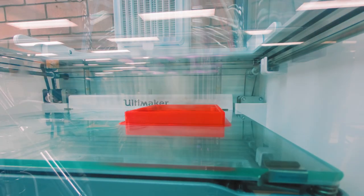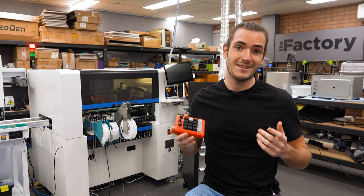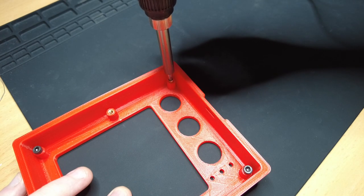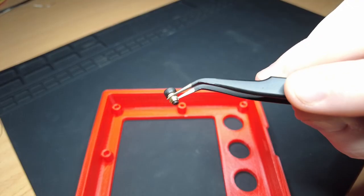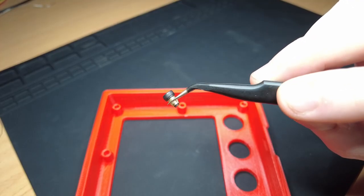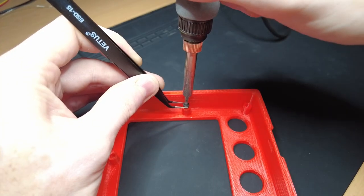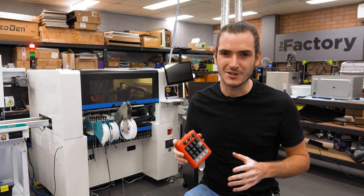The good news is the case has now finished printing, so it's time for a fit up. First the threaded inserts go in — this is my first time using threaded inserts and I'm kind of in love. A bare soldering iron tip worked best for me. I also tried indirect heating using a fastener pre-loaded to the insert, but I found that much slower and the greater thermal mass keeps the plastic softer for longer, making for some mushy standoffs.